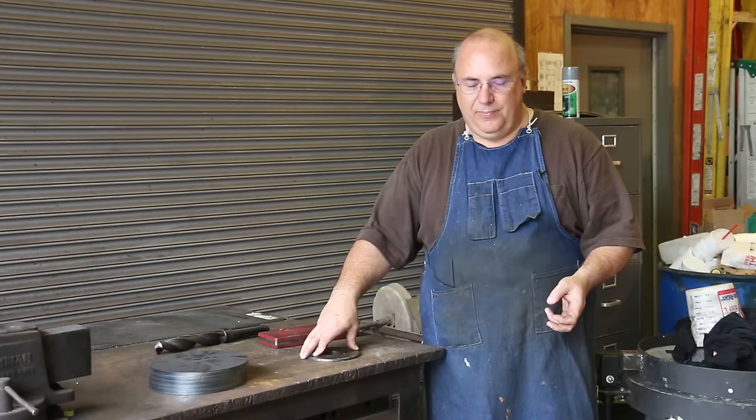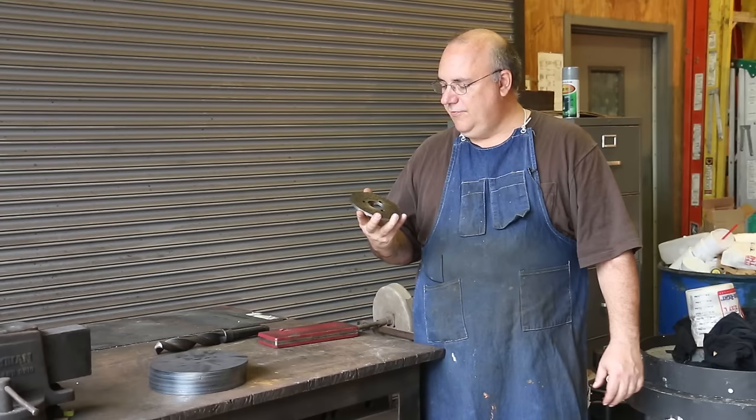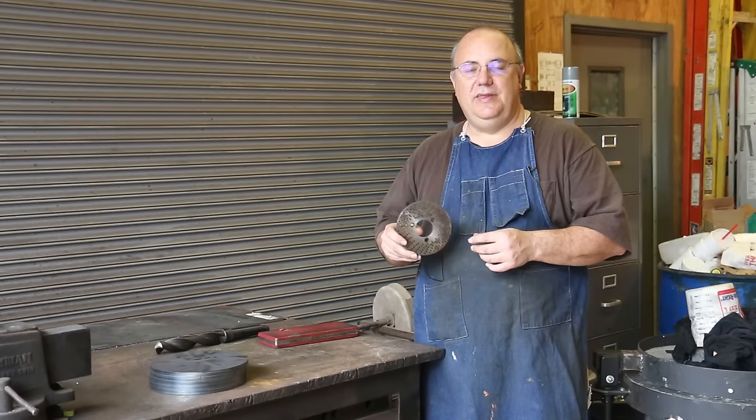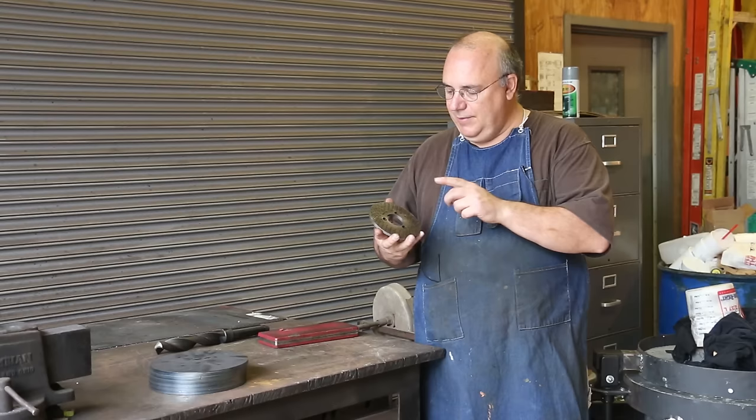And the problem I've got is the dividing head only came with one index plate. And there were a total of 7 plates that K&T offered for their dividing head. 3 of them probably do the majority of the indexing, and there were really 3 plates that came with the set, but then there was an option to buy 4 additional plates for some special indexing needs, but I only have 1 of them.